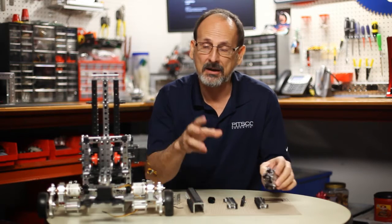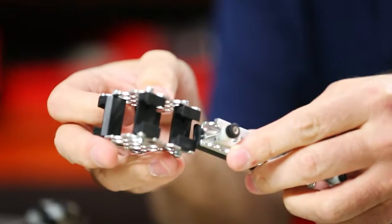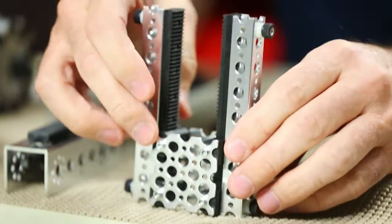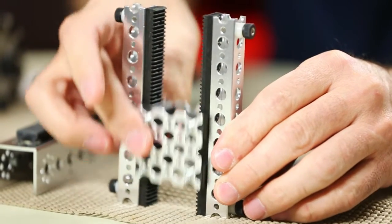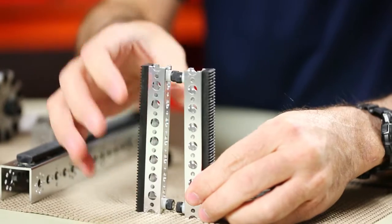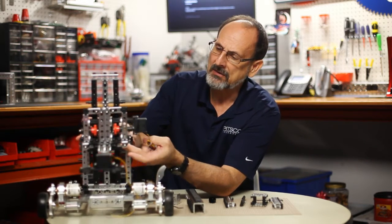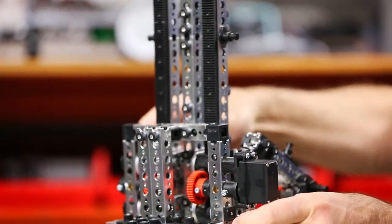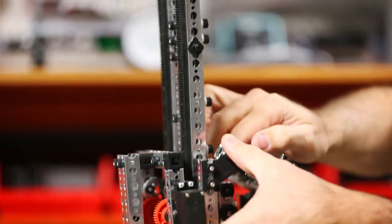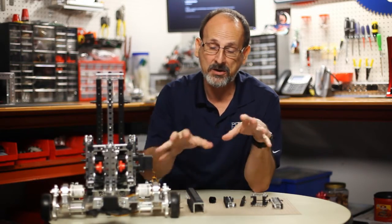Another example of connecting on two sides would be putting slide bearings on opposite sides, supporting it in two different dimensions, and then you've got a very smooth action supported on both sides. You could also do that facing in the opposite direction — create a carriage with bearings supported on the outside. This particular robot is an example of that: I've got two racks facing this way and a third rack on this side, so as my slides move up and down I also have one that balances and supports on the other side, giving a very smooth supported carriage.